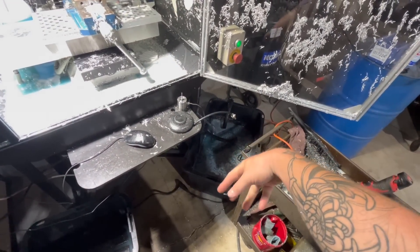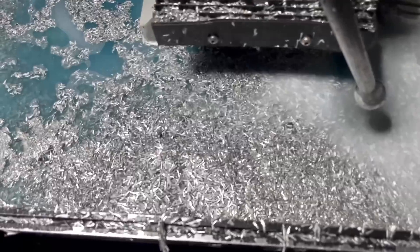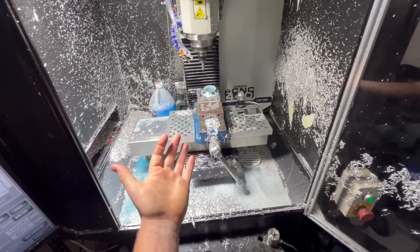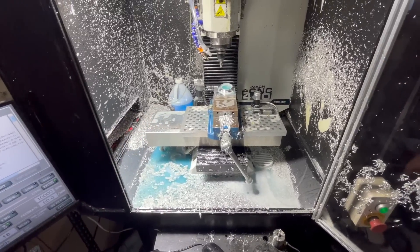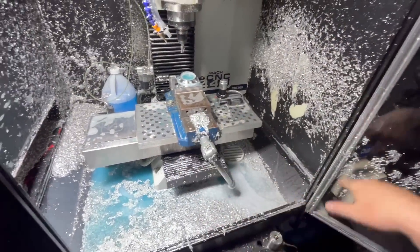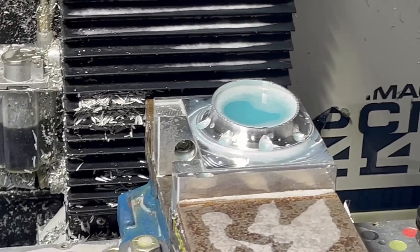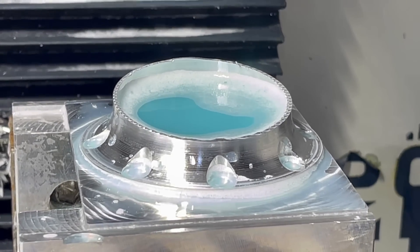The pump has a screen on it so I could just pump this out and vacuum the rest. A lot of this stuff is still staying contained. I don't have an auger so some chip buildup is inevitable, but to say I could use this for a whole day — I could probably go a couple days without cleaning it out. This is all reusable: it's circulating so I'm not having to put new fluid in every other day. And the parts look way nicer.